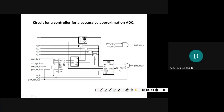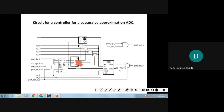Four analog switches are there, right? Bits 0 and 1. You can see there the analog switches. Y0, Y1, Y2 and Y3 are connected to the 4 switches here. These 4 switches are connected to the 4 multiplexer, 2 bits here. From where are these 2 bits coming? Q0 and Q1, these two are connected, right? So Q0 and Q1 will be decoded to 4 there.